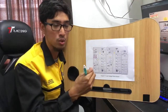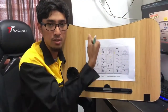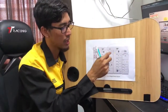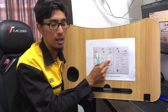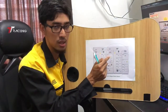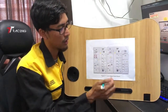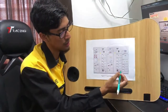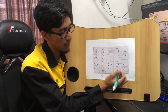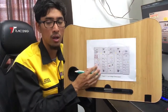To charge the coil for ACB 2, we pull the charging handle several times until the coil shows the charged status. Then we turn on the ACB for the connection to the bus bar and check the status. Then we go to the power factor capacitor here, and turn on the MCCB just like LVSB 1.